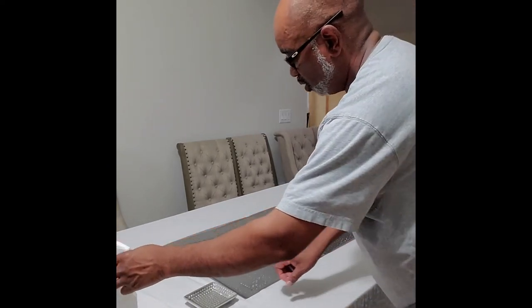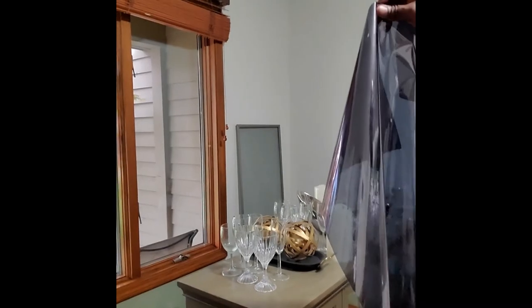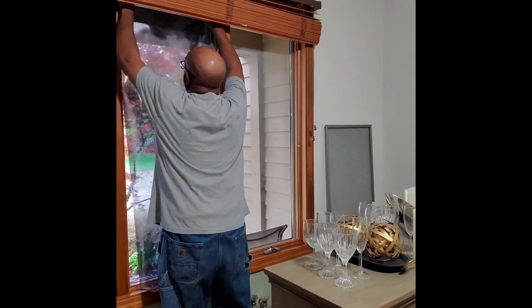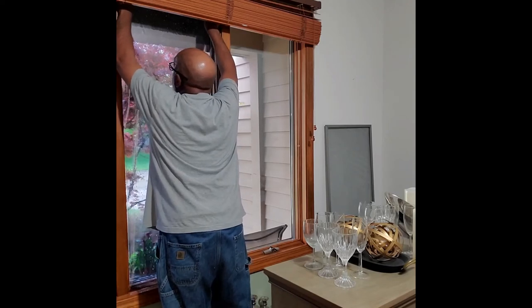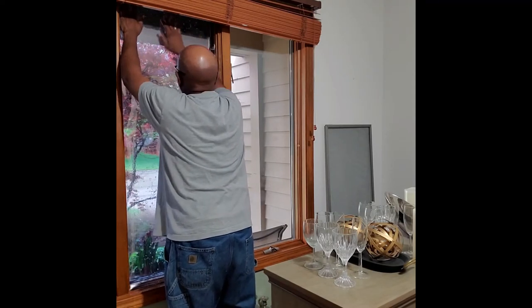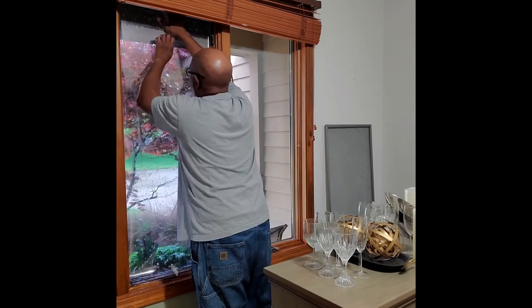So now we will take our window film over to the window and we're going to do an installation here. So I'm going to have you guys follow me. Ensure that you have the necessary overage on both sides of your window that was pre-measured for a good fit. And what we're going to do here is start to smooth out the film. Do this with your hands initially to get it to start to cling to the window.